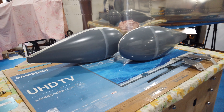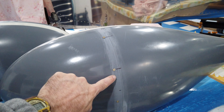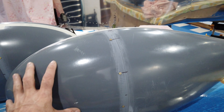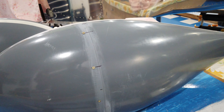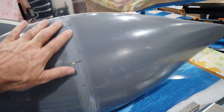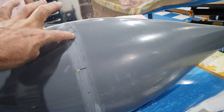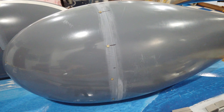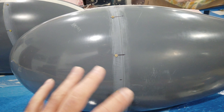The wheel pant halves are basically finished. I've got the nut plates in place and temporary screws in place. I have not countersunk the front nose piece for these screws, so they're standing up quite a bit - I'll countersink that later. The fit is really good now, especially with the screws in place, it draws things down nicely. Since I can now anchor them to one another, I can come back and clean up areas that are a little too tight.